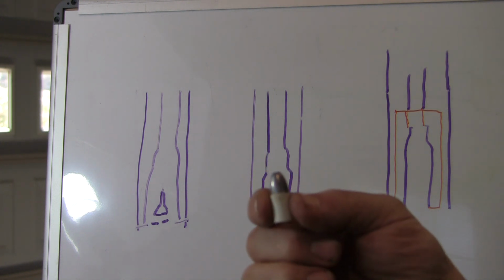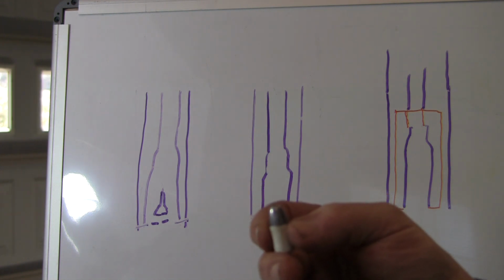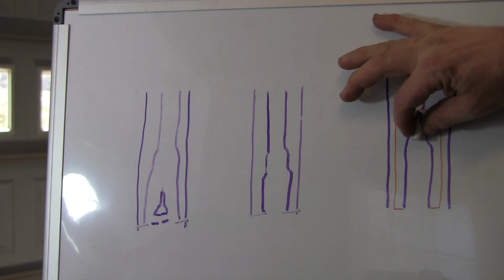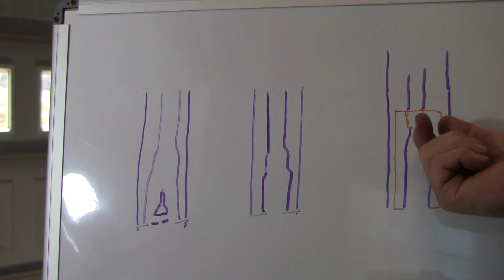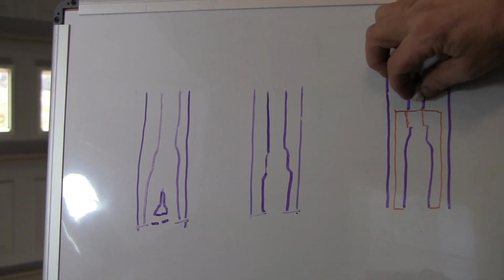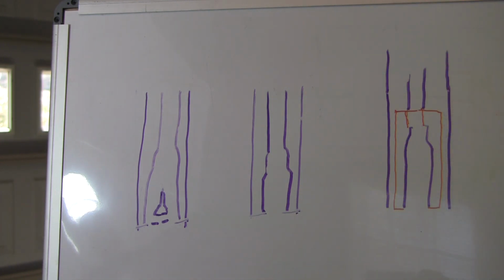If you take this paper patch bullet and measure where the paper is up here, it comes out to about 439. So how this would work is a paper patched bullet would be in there and it fits snug, or just a thou under. When you fire, it travels through, and this chamber is tight, or this constriction keeps the pressure up over that 1 inch. So then when it hits the open bore up here, it'll bump the bullet up, and then this bullet will act just like, it's kind of like a chamber extension for a certain type of bullet.